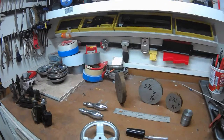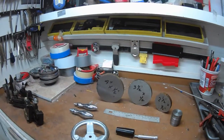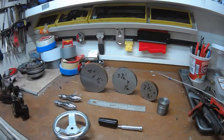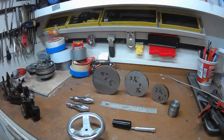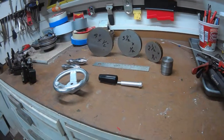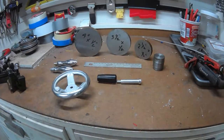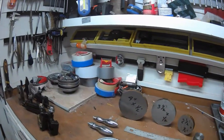You can get the metal stock in different diameters. I take a metal hub, cut it for the cross slide, then remount the center on the round stock and make a press fit so it stays in. The handles had cheap plastic knobs, which I replaced with brass, using the center stud in the steel wheel I made.